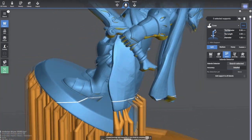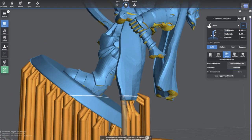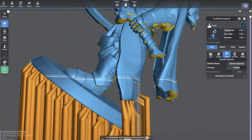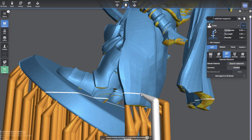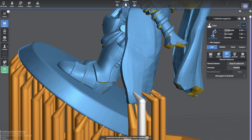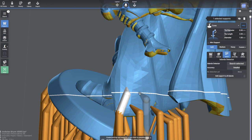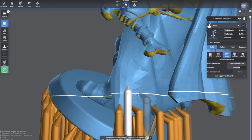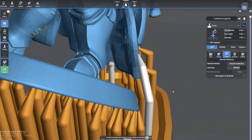And you're going to say, what happened? Why is my print deforming? And it's because it's just moving. As it goes in and out of the resin, it kind of pushes around and pushes the model. And even if these are stable, the further you get up here and the skinnier this part is, it's just gonna try to wobble on you. You could try overexposing it so that it's really stable, but then you could have layer separation if it's overexposed because the resin, the next layer isn't able to stick to it. So these are things that you just have to be aware of and careful about. And know, hey, if this has the potential to wobble, I'm gonna add some extra support here.